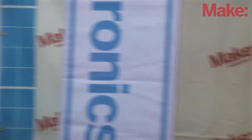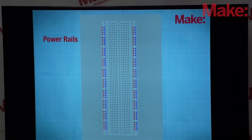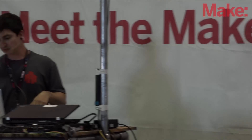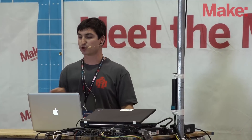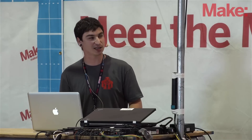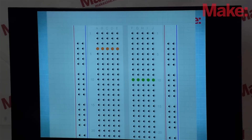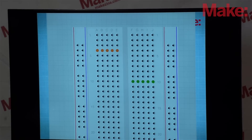One of the first things you'll note is a lot of perforated holes. The first set we'll be using are the power rails — they run up and down the board on the sides, and you can tie in your voltage source, whether that's a battery or a voltage source from your desktop. The next set of perforated holes go horizontally — those are the rows. Here we have the orange lights illuminate; all those orange connections are tied together, on row five or row four. The green connectors on the right-hand side are placed near row ten. So the way we use the breadboard is we plug components into these holes, then jump wires from different connections, and as long as the wires are connected to the right pins, we complete a circuit.